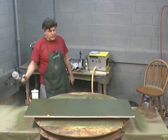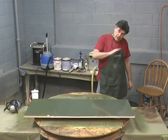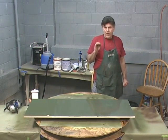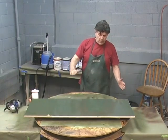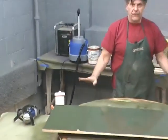That is what is referred to as a full wet coat. If I was putting that on a vertical surface, I probably wouldn't put it on quite that wet. Again, you can look at it, you see the gloss, you see the shimmer to it, and I'm hoping, Billy, can you get the texture on this? Now this is a solvent right off of the gun.